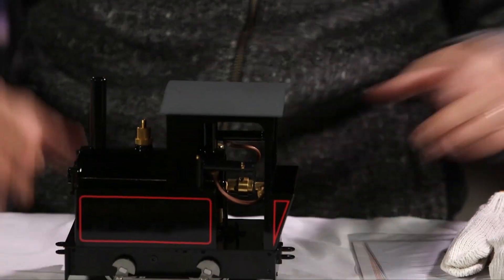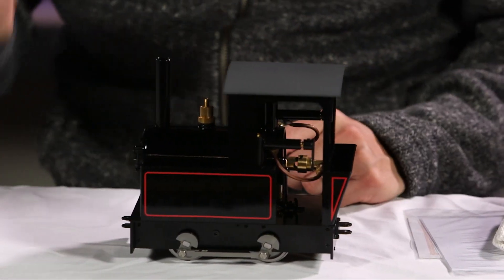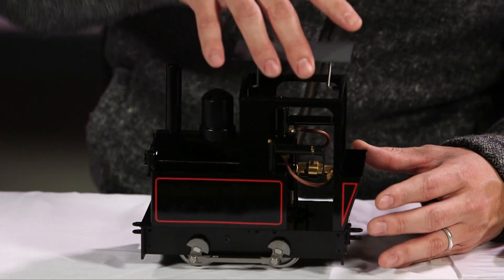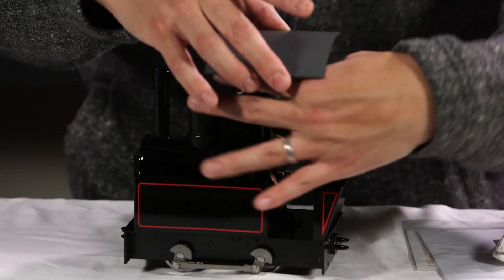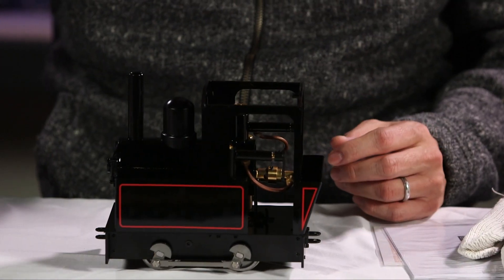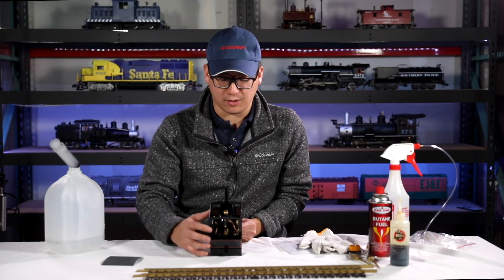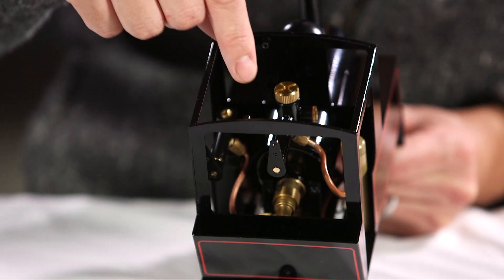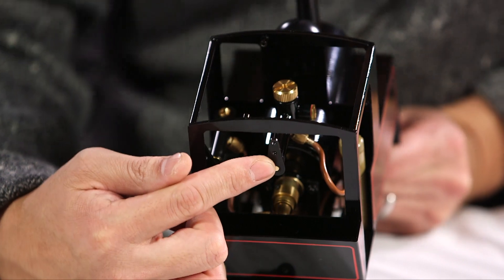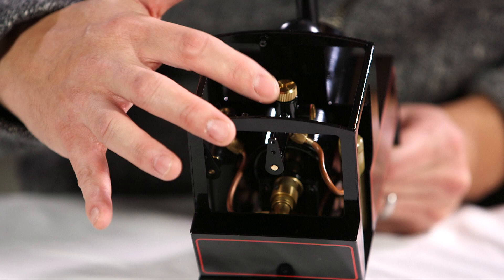This is the Dora. That's the safety valve — the steam dome just slips right over that. This is the cab roof, which you can squeeze to remove if it gets in your way. The first basic control is the throttle valve, also known as a steam valve, and that controls how much steam you're going to use and how fast your model goes.